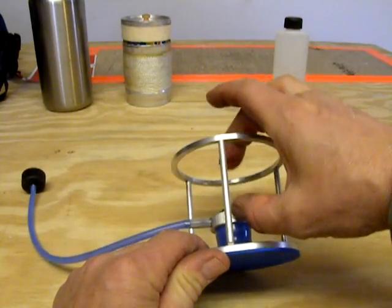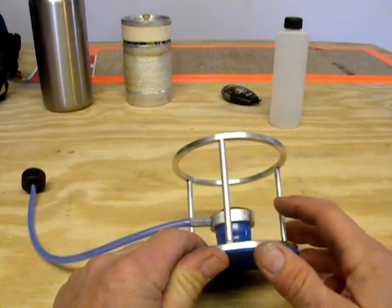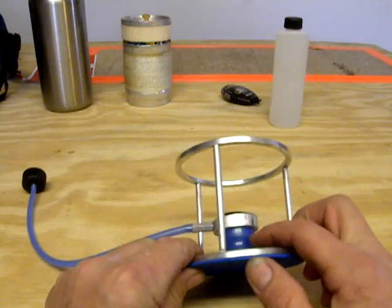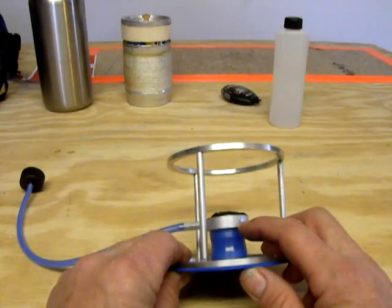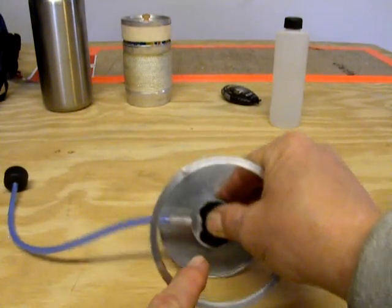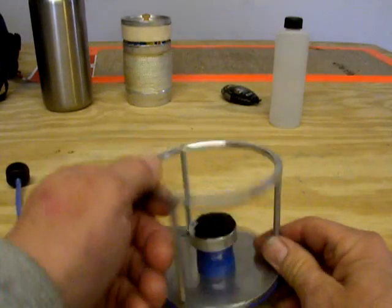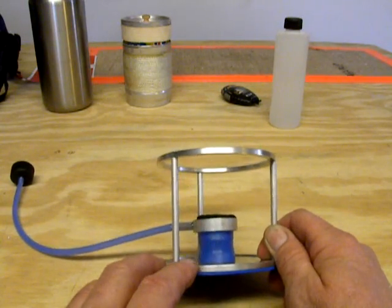I could make it longer, but that cuts down on the distance from the stove flame to the bottom of the pot, and that's fairly critical. So I was looking for a way to increase the volume. What I did was make this one three-eighths of an inch thinner and increase the length of the silicone tube by three-eighths of an inch, giving me three-eighths of an inch more room for alcohol. Rather than turning it in the lathe, I milled it and left that thick piece for thread meat so it'd still be rugged. In the end, with that extra three-eighths of an inch of space, I ended up with about another minute of burn time.